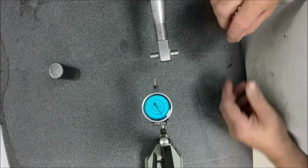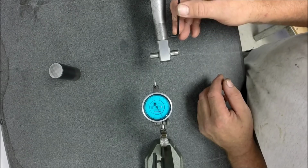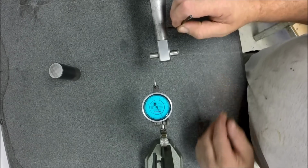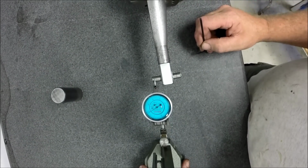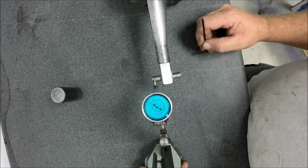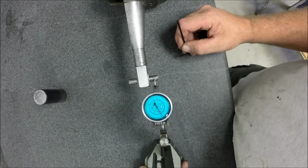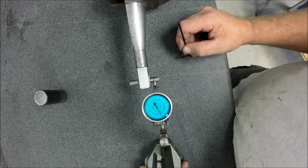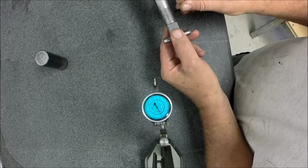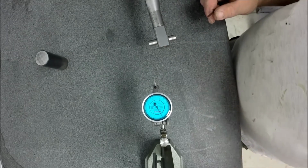All right. And then without breathing on it, we're going to just snug both of these up slightly, and then check it again. And then run it down and then check it again. All right, so we are at 3.3. Okay, so we're right at parallel with our 90 scale up on the dresser.